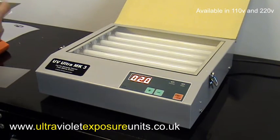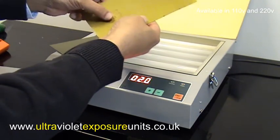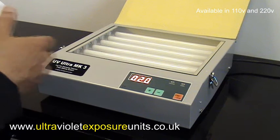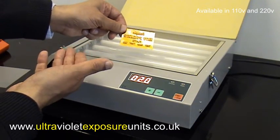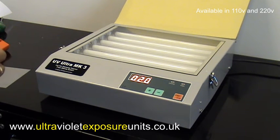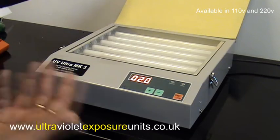I'm going to show you a printing plate I made previously. That was a blank plate and this is the finished plate. As you can see from the artwork, there's the etching — it's a fairly shallow etch for pad printing, but if you run your finger you can actually feel the design. That's essentially how exposure is carried out on this UV exposure unit, whether you're making hot foil polymer plates, rubber stamps, letterpress plates, or stencils. They all have different exposure times, and for the products we sell we'll gladly give you the exposure times needed to get a satisfactory plate.